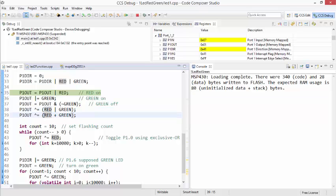Now, another notation you could also use is the plus. It happens that because this is a 1 and this is hex 40, if you OR them together or add them together, the result is the same. So either way will work. It all depends on preference. All right, so a few things to notice: practice through each one of those combinations, and understand the P1OUT and directions. And if you want to explore the P1IN, I think that would be great. Okay.